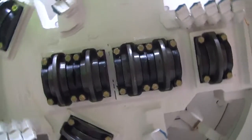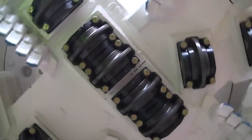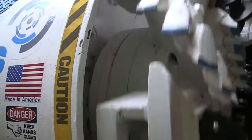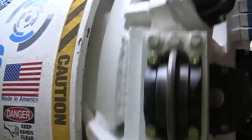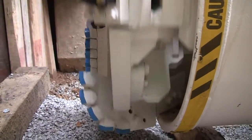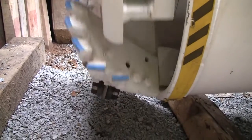The mixed ground cutter head was specially designed for ground consisting of claystone. The cutter head is mounted with 14 single disc cutters 6.5 inches in diameter. Large openings, called muck buckets, are designed to scoop up and transfer muck from the tunnel face.